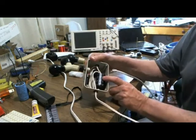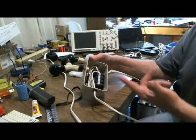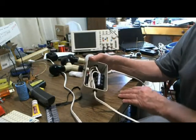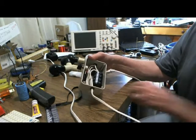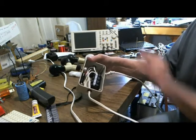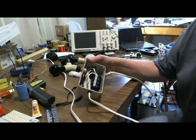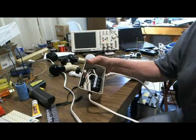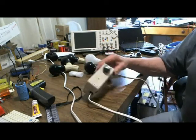One cap — 1500 microfarads. A lot easier to build because you only have one cap to work with; you don't have to have a whole series of them. This cap is rated at 250 volts and its temperature is rated at 105 degrees C. Believe me, nothing in here gets anywhere near that hot — nothing gets really hot inside the circuit. The bulbs get hot, but nothing inside the circuit.